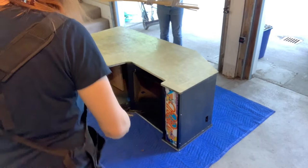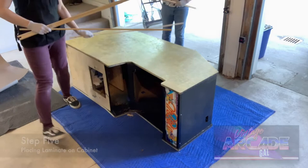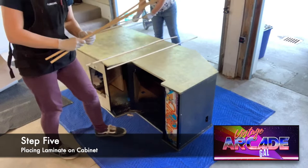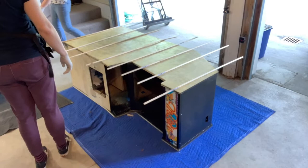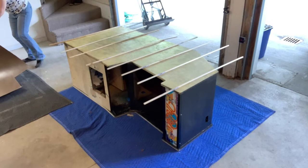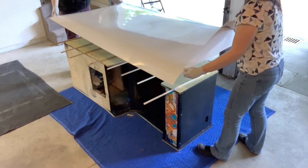Now that both surfaces have two coats of adhesive, it's time to put them together. Get out your dowels and spread them out — you really need two people for this, I can't imagine doing it alone. Space the dowels about eight inches apart. The dowels will not stick to the glue, and the reason we use them is so when we lay the laminate on top we can still move it around. This is also why the laminate needs to be larger than the surface — it gives you leeway to adjust positioning.